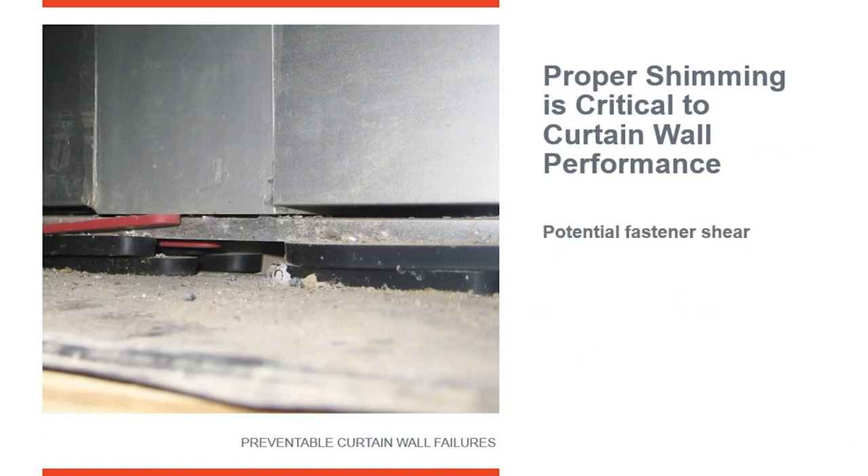The proper location of shims is between the anchor and the bottom of the vertical member. Here you can see the shims are underneath the anchor. In the example I showed earlier with the elevation that is 25 feet tall, the wind reaction was just over 1,600 pounds at the top and the bottom. When you shim the anchor up like in this picture, there's a problem.